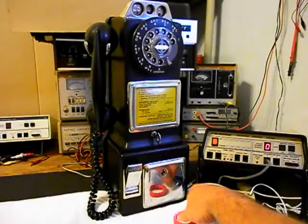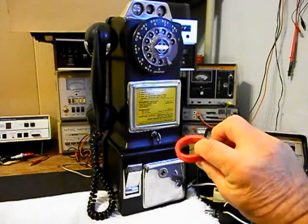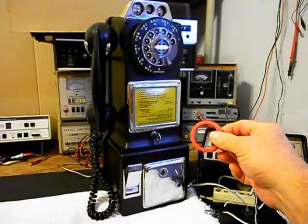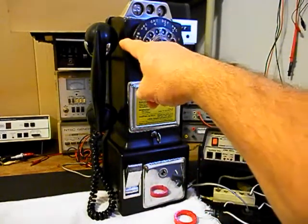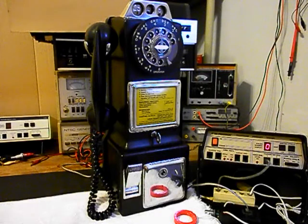Now we also want to mention our amplified pickup. We use this in troubleshooting, repairing, and on our final checkouts. It's amplified so that you can hear the audio from a receiver. And I have an amplifier back by the video. It has a button on it, and when I press the button, I can give dial tone or take it away at any time. Since it's an open amplifier, it is prone to any static interference or noise in the atmosphere. So if you hear any kind of a staticky hum or an electrical hum, that will be coming from the amplifier and not the payphone.